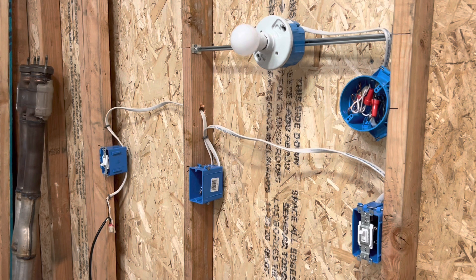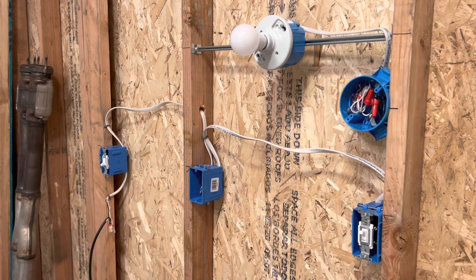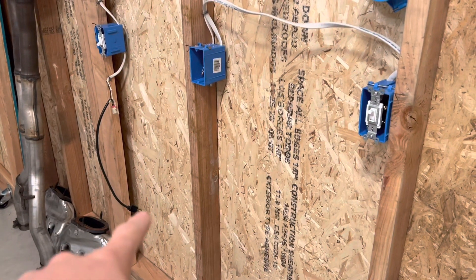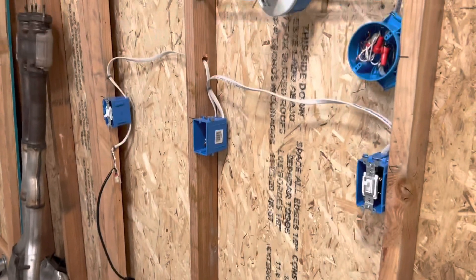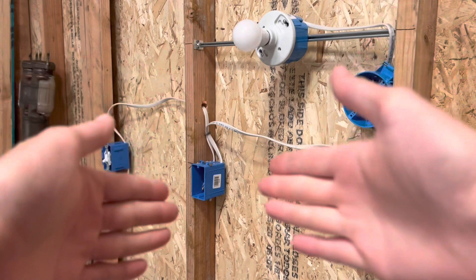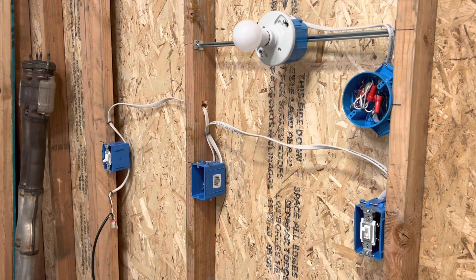Today I already made up the three-way switches, I'm just going to do the four-way switch, so this video will be super short. I also did the power whip already and connected that to the 14/2 Romex, so that will be ready to go. Today I will just be showing you how to install the four-way switch.